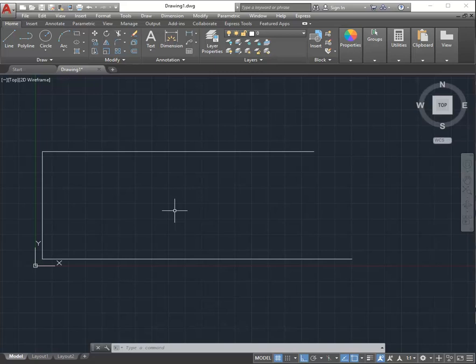And so again, if you remember 110 for the width of a brick, and then cavities, if not specified, are normally 50. So between the bricks, you've got a 50 mil gap. That means 110 plus 50 plus 110 gives us 270. So that's a standard cavity brick wall. If you remember that, 270 is a good one.